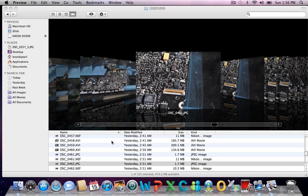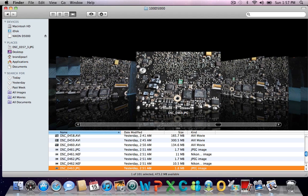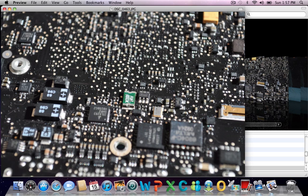Those fuses will be down further here. This will be the USB fuses. Same type of principle — power comes across the board here, goes to the fuse, and then comes to where this QFP package is, and then diversifies itself through the USBs for 5V power. The fuse is protecting the rest of the circuitry, but also supplying power to the USBs. So if the USBs overvolt, it'll only burn what's on this circuitry past the fuse — fuse to USB, that's how that'll get damaged.